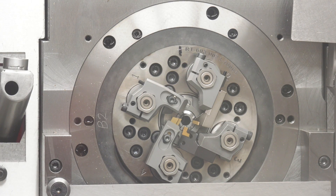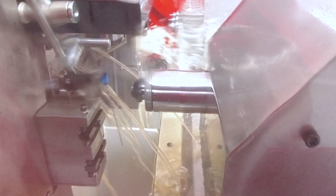Exactly. So there's no cut-off end, and that is the speciality of Escomatic. That's what we built our system on — removing the part runoff nose. The rotating head lets us support the part while we're cutting or working the piece.